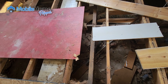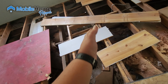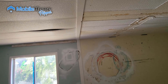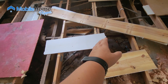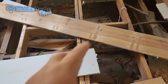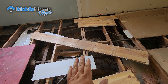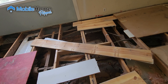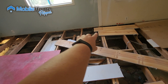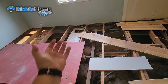This is the frame the home actually sits on — this is the frame that goes down the road. What you can actually see here is the marriage line, and that's the connection point. That's the reason why you have double pieces of wood down the side — double floor joists — to help with the bracing. As you can see, it slants down, gets thicker, and then slants back up. That is the towing portion.